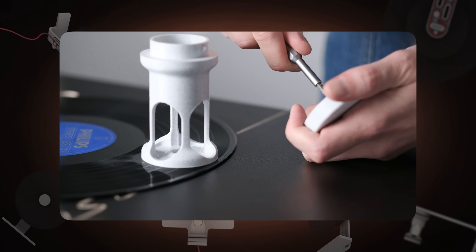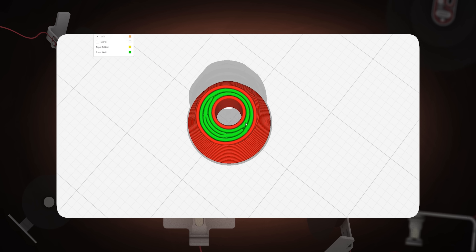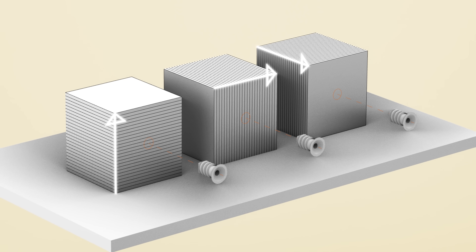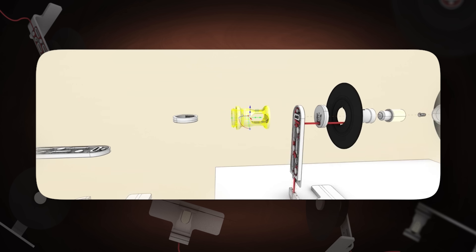To strengthen my joint I used a screw and a bolt. Apart from the fact that there is a screw, these outer walls make it stronger as well. The second thing you should keep in mind is the print orientation — so if you were to screw something into this block, it's preferable to go from this side.